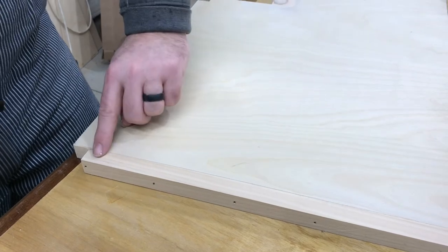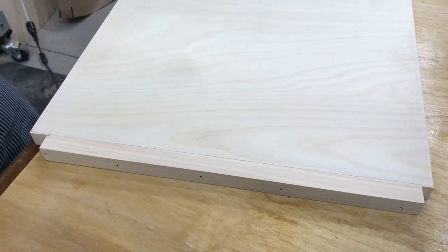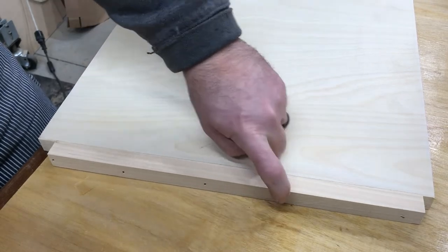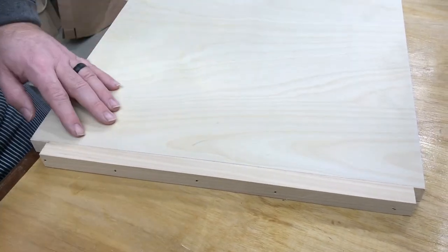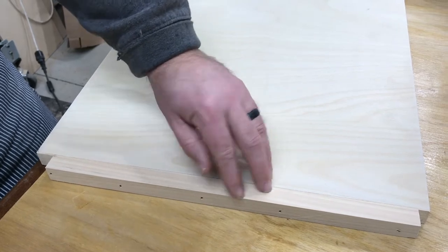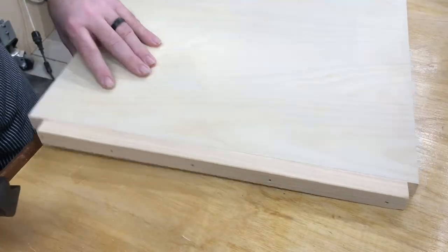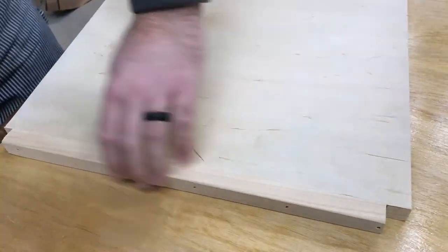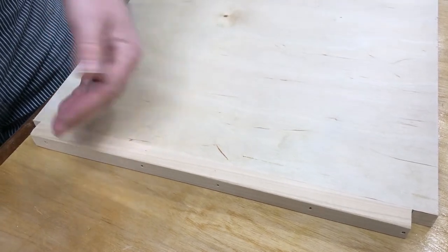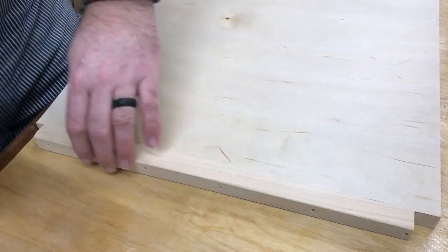On the plywood shelves I put a piece of three-quarter inch poplar as the hardwood band. You could get away with a quarter or half inch, but I don't have good luck with iron-on edge banding, so I glue it and shoot nails in for structure. For the corner, instead of rounding with sandpaper — which can create divots — I just hit it once with a hand edge plane. You could also use a router with a sixteenth or eighth inch round-over bit, but the plane is just a whole lot faster.